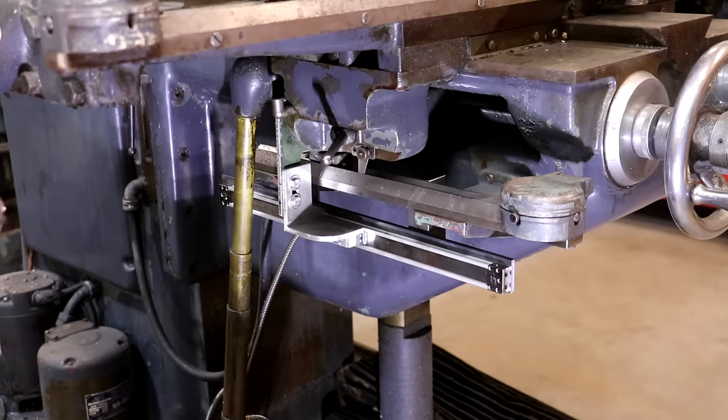Let's do a bolt hole pattern, something we used on the other DRO recently. Going into the function mode, it's got all kinds of functions: bolt hole, line hole, grid, frame, arc contouring, R function pocket, and more. The line hole is for drilling holes along a line, calculating spacings. Grid is for laying out a grid — like a two-inch by two-inch grid, even on an angle — and it drives you to all those points. Arc contouring is like a manual CNC: it gives you X-Y coordinates to inch around and produce an arc. I've used that on my other DRO a time or two — it doesn't give a perfectly smooth arc, but it can get pretty good.